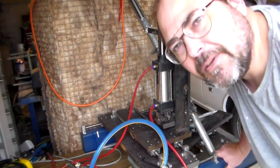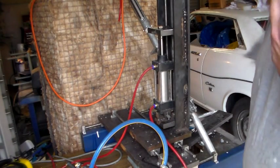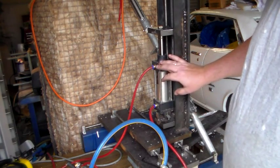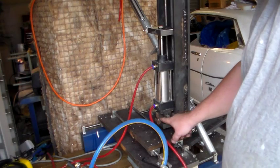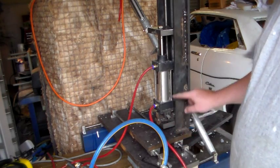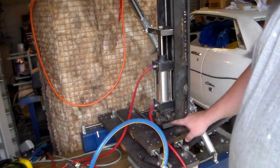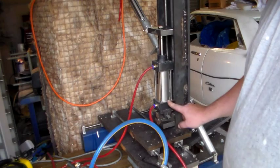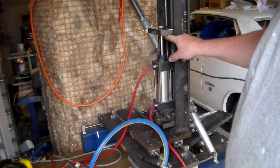So I've made a little bit of progress off camera. I'll just bring you up to speed with where we're at now. This is our upright Z-axis and I've now fitted the lift ram in here to the bottom plate. This is the plate that has the nut welded to it to go up and down on the threaded rod that was in the middle. I've just welded an upright plate in here with a hole through the middle to take the pin on the bottom of the cylinder. I've also drilled a hole in the top plate for the ram to fit through the top plate there.